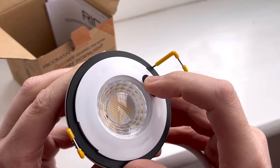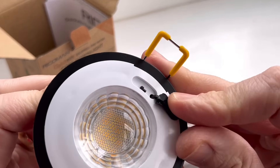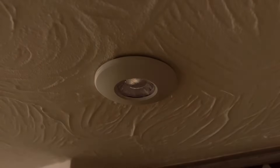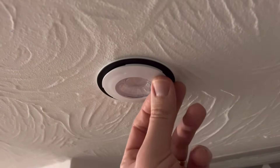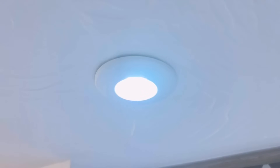Hiding under the decorative ring is a little ceiling flap, and behind that is a little switch that allows you to change the output of the light between a warm 3000 Kelvin and a neutral 4000 Kelvin. Placing the switch there is such a smart move, because if you want to change the colour after installation — maybe because the customer changes their mind — it's effortless to access it by twisting the bezel off, rather than removing the whole fitting from the ceiling.